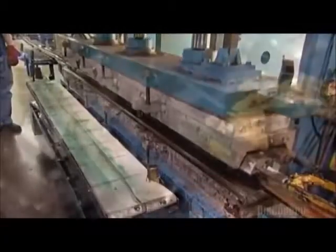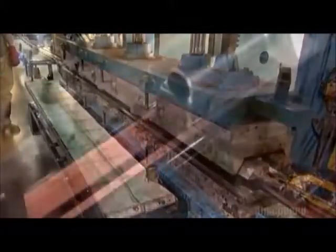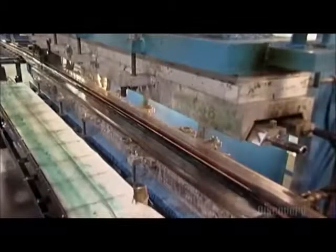The top part of the mold lowers, and the handrail bakes under high pressure at 180 degrees Celsius. Ten to fifteen minutes later, the mold lifts, and a chemical reaction called vulcanization has occurred. The layers have been laminated, and the handrail is now strong enough.